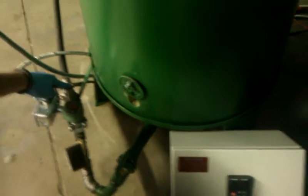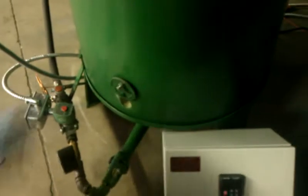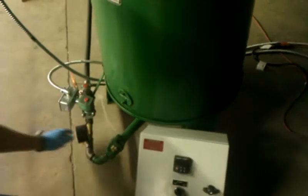Push down on the Baso safety valve until the pilot is lit. The valve must remain pushed for about 15 seconds until the thermocouple is hot. After that, close the pilot lighting hole, turn on the main gas supply.